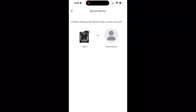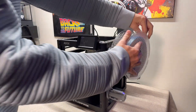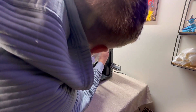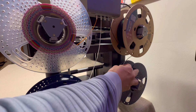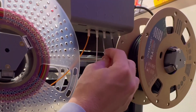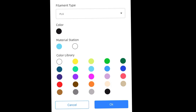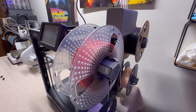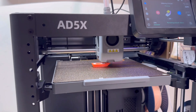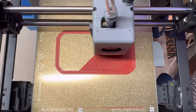If you get on the FlashForge app, you'll notice it shows your 3D printer and it should say it's idling, live, and ready to go. Then you can start adding filament. Put the rolls of filament on the sides — make sure you have one kilogram rolls because the smaller ones won't fit. Feed the filament into the same numbered chamber as the roll you're putting on. So roll number one goes into chamber number one in the PTFE tubes. You can also jump around in the app and choose your filaments. The AD5X comes with some 3D prints pre-loaded that you can print right away, but chances are you'll want to use the slicer. I highly advise checking out my next video walking you through connecting to the slicer so you can find and print whatever you want.